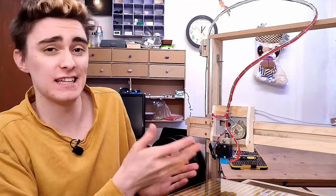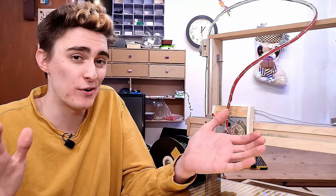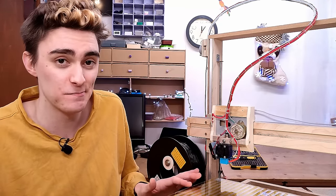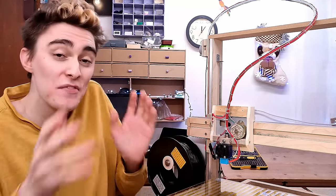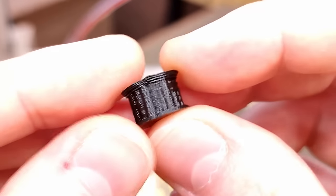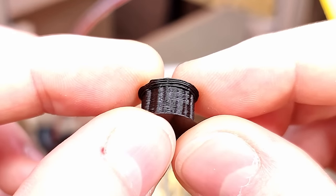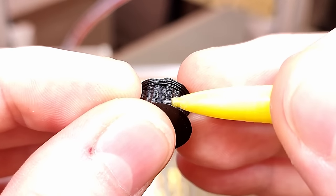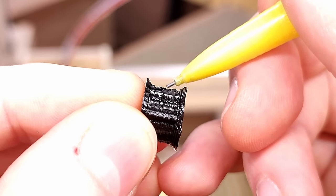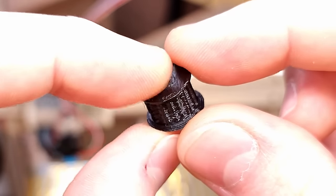And because it's a purely physical issue of my motors not being able to retain the rotor in between those full step detent points, I do not believe any amount of input shaping or other Klipper magic is going to fix this. Like, if I set those motors to microstepping, they just wait until all the 16 microsteps are over and then do one full step. To demonstrate this, I printed a pretty standard 20-tooth pulley earlier, and you can see it's not fully formed. Some of the teeth are almost nonexistent, and others it seems like it did them half the time, and half the time it didn't. So overall, for small pulleys and gears, the result is pretty unusable.